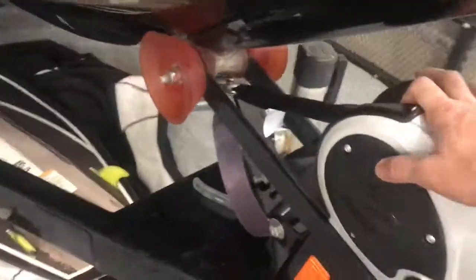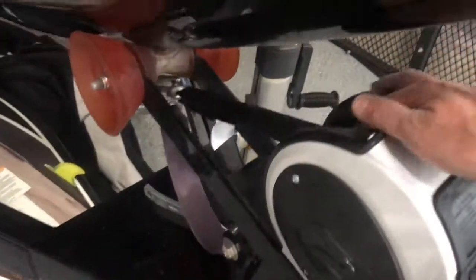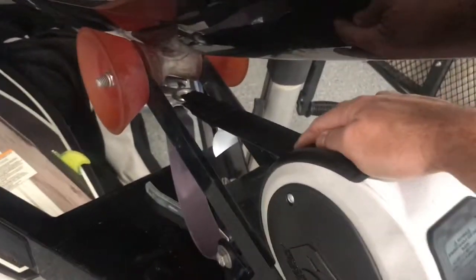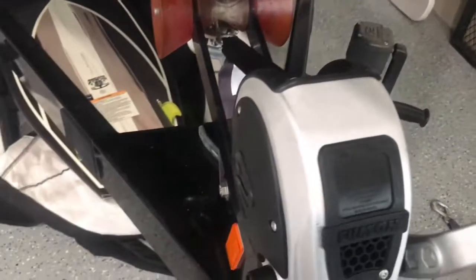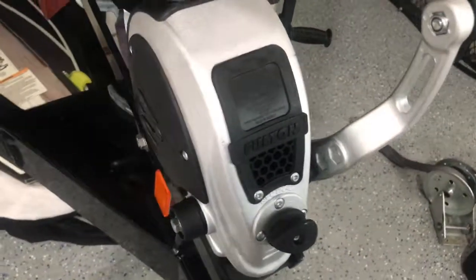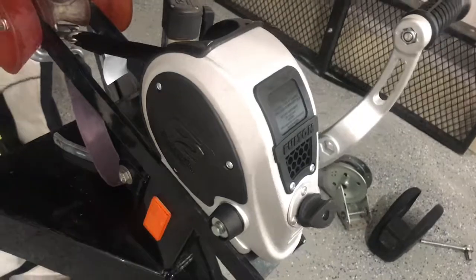Got this all buttoned up, everything tightened down, strap on the bow eye. One thing to be aware of when you put a new winch on: the bow eye needs to be right against the roller. Once you winch it up, you want to do that a couple of times so the strap gets really tight on the drum. Otherwise, when you pull out of the water, the boat could slide back on the trailer. Just re-tighten it a couple of times a little more than you think, so it doesn't move on you. But once you get it broken in, this is an awesome winch — the Fulton F2, 2,000 pounds. Thanks for watching, be sure to subscribe.